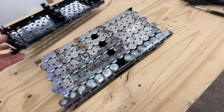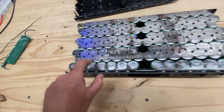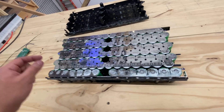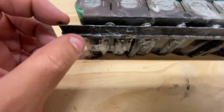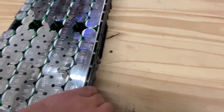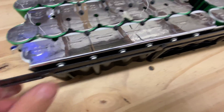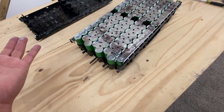There we go. And then you can see the tabs there. Is it 14? Yeah — 1, 2, 3, 4, 5, 6, 7, 8, 9, 10, 11, 12, 13, 14. 14 cells. These have the bus bars there. The bus bars are attached to that big piece, the bus bar, and then it's got screws. These ones are all rusted because of the flood, but here you can see the good ones. Taking this module apart is not that hard — it took me a couple of minutes.